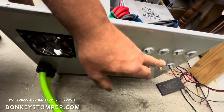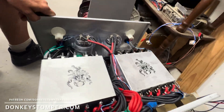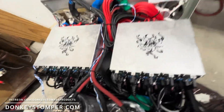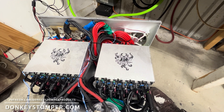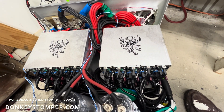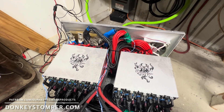You've got four grounds on the shunts. This fan is blowing in, this one is pulling out — plenty of airflow. This is for me; I didn't do this to show off or anything. I had to go ahead and build my power supply because I didn't have a shop supply big enough to work on a 32 pill, 64 pill, or 48 pill amplifier. I sold my old supply that used to sit right here, which forced me to go ahead and do it. So this is my new bench supply.